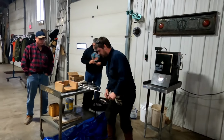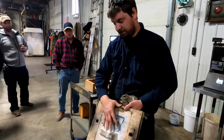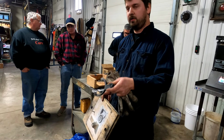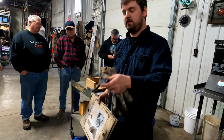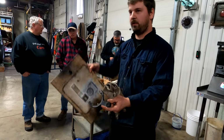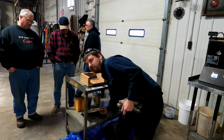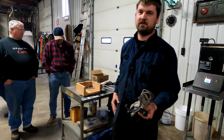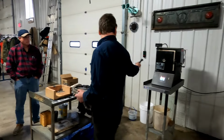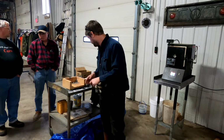So earlier I did a pattern mold, right? This is a match plate that makes the part, and this is very efficient. I have what's called a loose pattern here. I just need a flat board, and instead of squeezing both halves, you make one half, remove the board, and then put the sand in without the board. It's a longer process, and it's more labor intensive, but in some cases, it's more cost effective. If there's enough interest, the metal is still at about 1900. I can throw some more metal in, we'll have 30, 40 minutes, and I'll make another one.